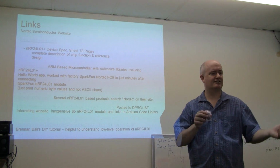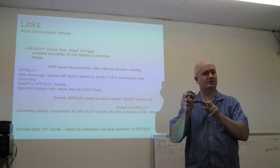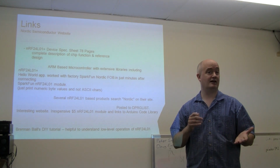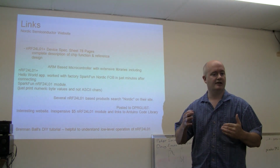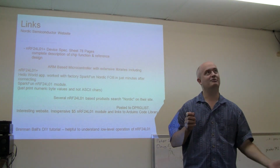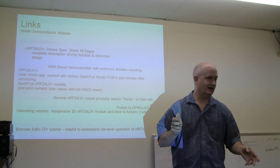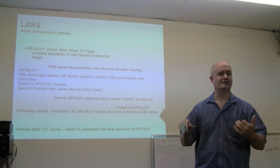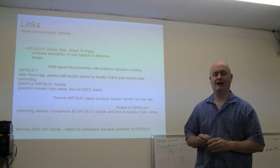But I do like, of course, the XB for the fact that you can do like a 2 or 3 wire setup. And the other thing is, even though the data communication between your host and this device is quicker, it takes you a little more effort to output that SPI data. Well, if you have a dedicated SPI UART, or USART or whatever it be, I guess then you don't have much overhead concerns. One of my things is I've done a number of different designs, and I end up doing like a bit bang SPI interface. So I end up just manually pumping the bits out to the device. And then that starts to cost you. And you'd say, wow, if I could use my UART to jam it out there, then I would. But maybe that argument doesn't hold real well, because most things will have an SPI hardware interface. So maybe I'm kind of babbling.